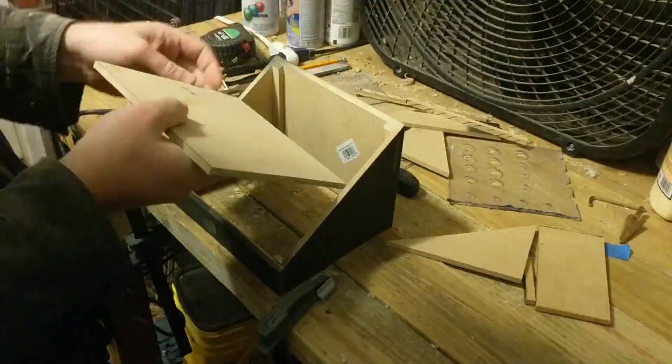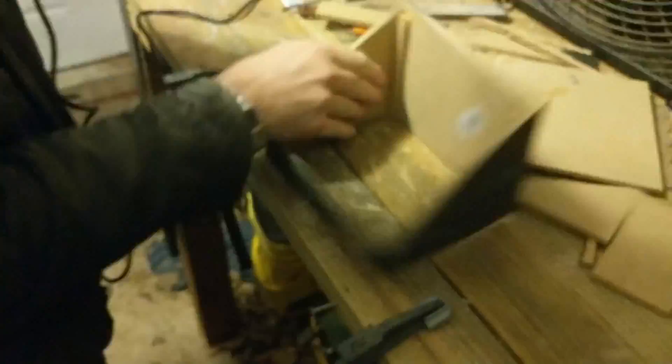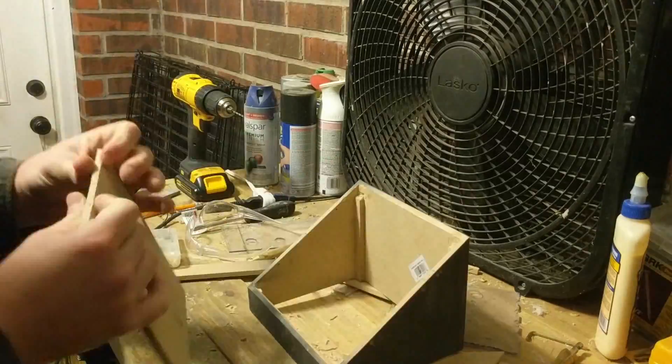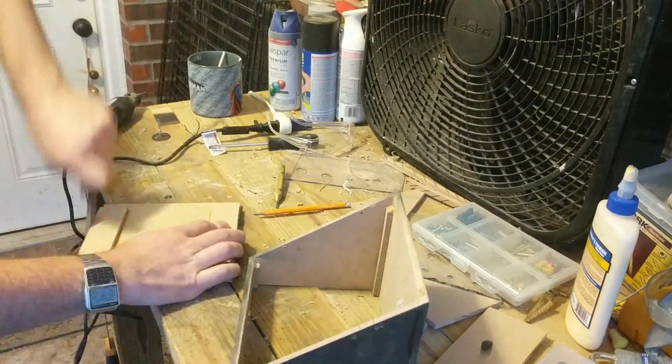So I decided to do something different. I don't have a table saw at my house, so I had to hand saw the extra material off of the bottom piece so it would now fit inside the bottom of the box. I did you the favor of blurring out this footage so that you would see less of my mistake. To fit the piece on the inside of the box I had to carve away at those thin pieces and angle the front edge of the bottom piece, but in the end it all worked out and the piece sat flat inside. Now it was time to add the screws to the side — and also time for mistake number two. I was drilling a blind hole into the edge of a very thin part and drilled too close to the edge, causing the material to split. To remedy this I added a second piece above where the holes were going to be drilled to add material. After a quick gluing and clamping I was back on the road.